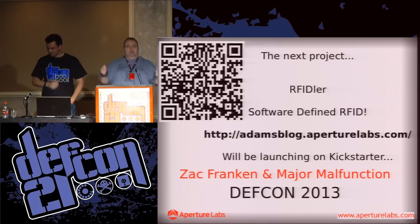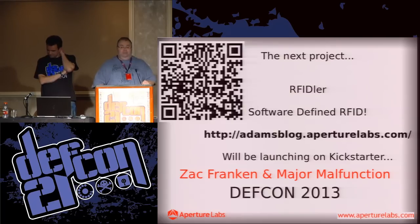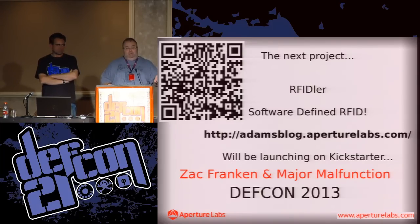Normally, a lot of the security is crap. They're taking the crown jewels, their super secret master keys, and they're storing them in chips that aren't really designed to secure keys and things like that. So we looked at an RFID vendor and their latest and greatest product, and they'd stored their keys in a PIC chip, and we sent it off to a slightly dodgy company. And they said, oh, that will be $900, sir. And they sent us back an entire dump of the code, including all their super secret keys. We've had chips reversed that have cost as little as $90. So if you have a cheap PIC chip, $90 will get you the code. With the higher end chips, they put some effort into trying to prevent this from happening, with proper on-die security.